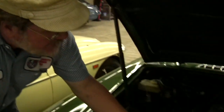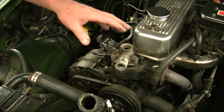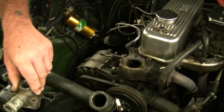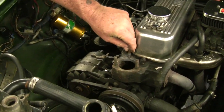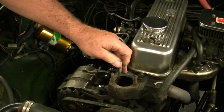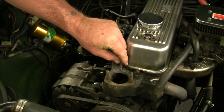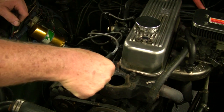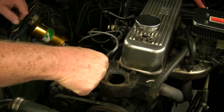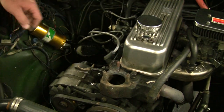Once we did that to all the studs, we could get a knife blade underneath here, found some screwdrivers and levered the housing up. Once it came off, we had to get the broken stud out. Now, this is similar metals — steel and cast iron, close enough. So here we had to heat it up, got it very nearly cherry hot, put a pair of vice grips on it, and kept wiggling it until you could feel it was actually turning — not just twisting, but turning — and then walked it out.